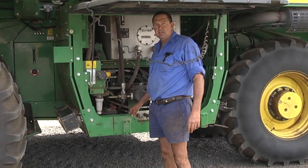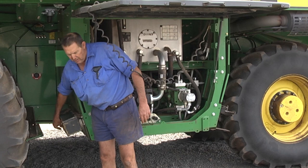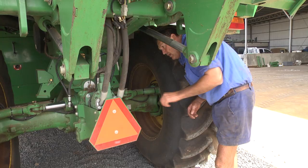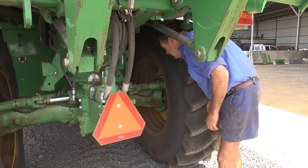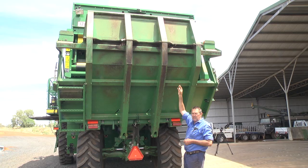Similar to the other side, you've got a few little places where trash sits — in around here, around your hydraulic motors, on your mud scrapers, and even in our case we have a little toolbox on here and it's quite often full of trash. Again you can drop your belly plates — it's a good idea to check it. In behind this hazard sign here, around the hydraulic motors, around the rear axles and in your steering knuckles.